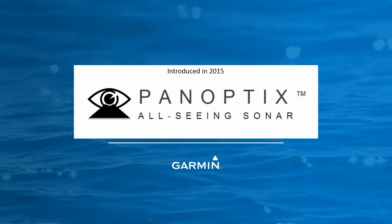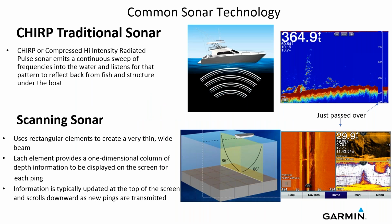To best explain how Panoptix works, I want to first talk briefly about some common sonar technology on the market today. Most of us have used or are using some type of traditional sonar, basically a dual frequency. Most sonars out there today are dual frequency. They shoot a 50 kilohertz and a 200 kilohertz frequency in the water. With the introduction of CHIRP technology, which stands for compressed high-intensity radiated pulse, we now have the ability to scan basically the entire CHIRP frequency between 40 and 230 at one time.